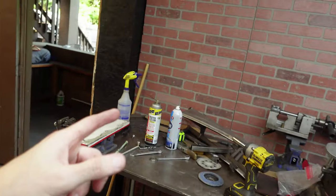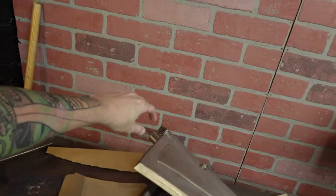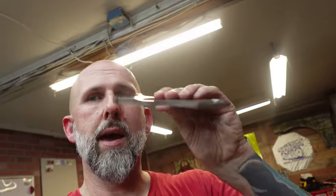The fork itself is not long enough at the top, so when I put it on, we had about this much left where you couldn't put the top hat on. So what I think I'll do is I'll just TIG weld some 1-inch, make it a little bit taller. I don't think that thing's really there to do much structural wise. It's just the top hat to the fork and it just sits there anyway. It doesn't bolt on or anything like that. So I don't think that's gonna hurt anything. We'll probably TIG weld that on, smooth it out. I'm gonna come back to that.